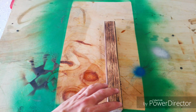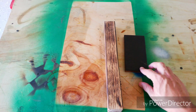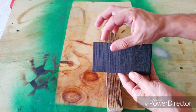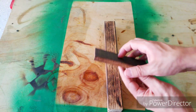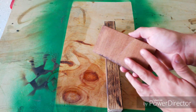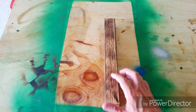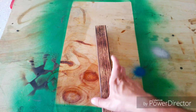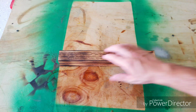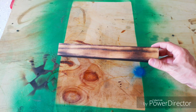Unlike the teak wood, which I did before, where it's all hard and it's all very tight grain structure. So it's all going to char at the same time, and you can't really do a light charring on that because it's just going to deform it with the fire. But that's why it's nice about oak. If you want to do this kind of style, the pika pika Shou sugi style, you can do that and still get a nice rustic fired look.